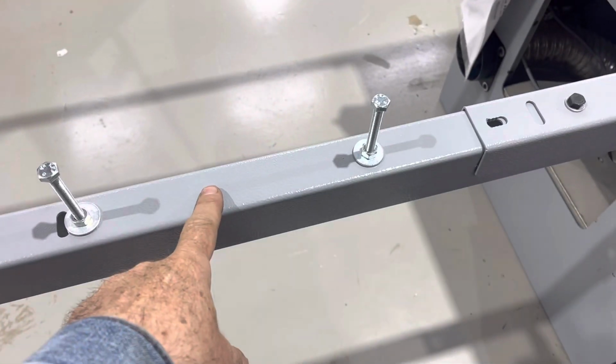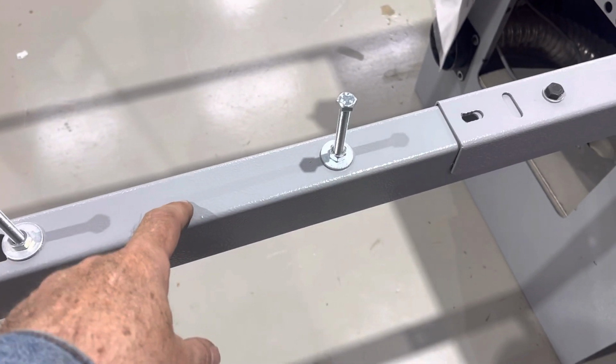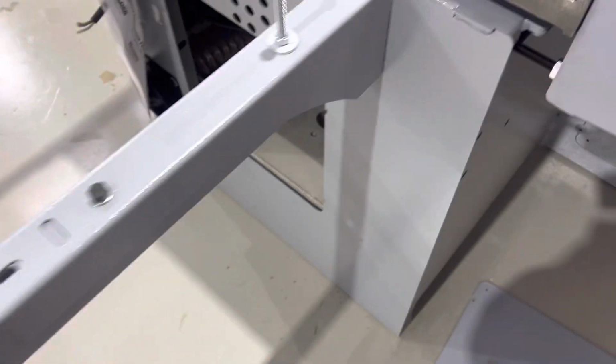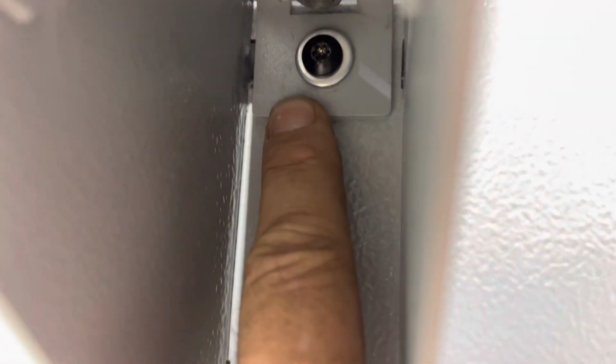Now, this bar was in the slider box, as far as I know, unless I moved it when we unpacked, but I think this was in the slider box. So A, we didn't know where this was. We finally found it. B, something to note: this little screw here, it's a T20 screw. It is self-tapping. The hole is not threaded, and it's really hard because it's very thick steel. You have to tap that screw in. That's going to confuse you.